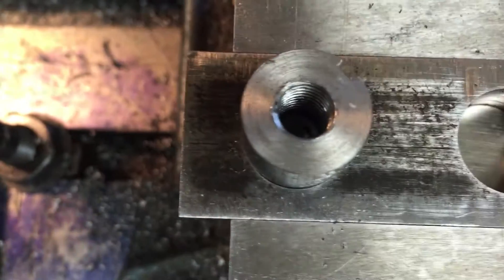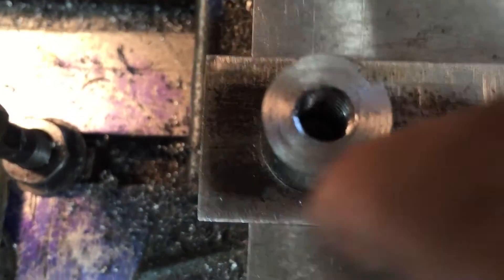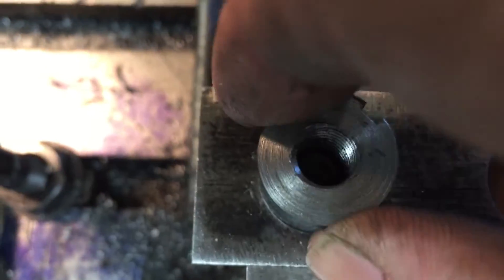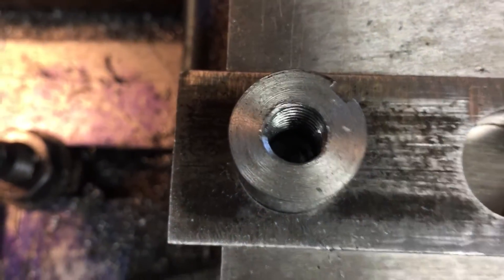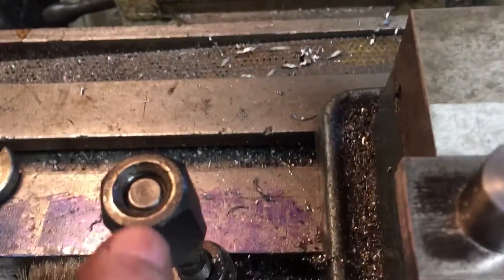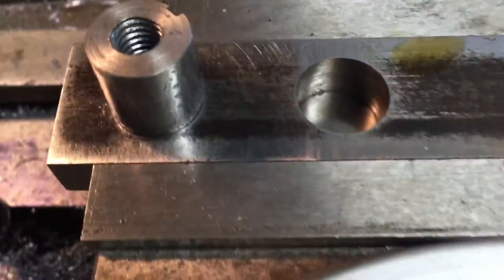I have this clamped in. I have the spindle, and I indicated off of that diameter, which is the bore of the axle in the hole. You'll see there's a wheel and I have the keyway cut. There's a jack right here — that just keeps it so if I drill in here, it doesn't push down. It's in there pretty tightly.